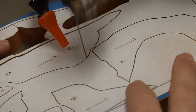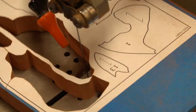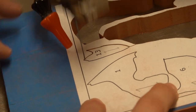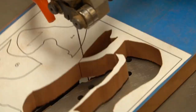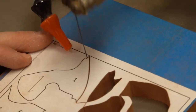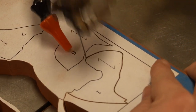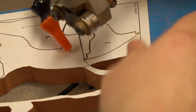In the scroll saw group on Reddit, somebody asked if cedar is a good wood to use for scroll saw work. I think cedar is a great wood, especially for intarsia, but you can also do fretwork and segmentation with it. You have to be careful because it is fairly soft — you don't want to do very fine thin fretwork. You can do things with a lot of inside holes, but you want to leave enough thickness and width so the fretwork doesn't fall apart.